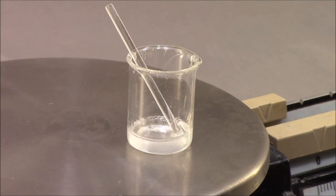The curing time on this is 5 to 7 days if you just let it sit on a shelf at room temperature. I can accelerate that by adding heat. I'll take that object that I put the Hxtal on back in the hot box, pull it out in about 15 minutes, wipe off the excess, put it back in the hot box, and then that's cured in a day, 1 to 3 days, depending on how much Hxtal I'm putting on the object.